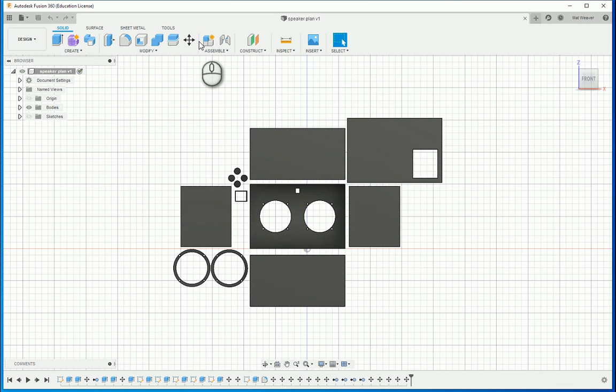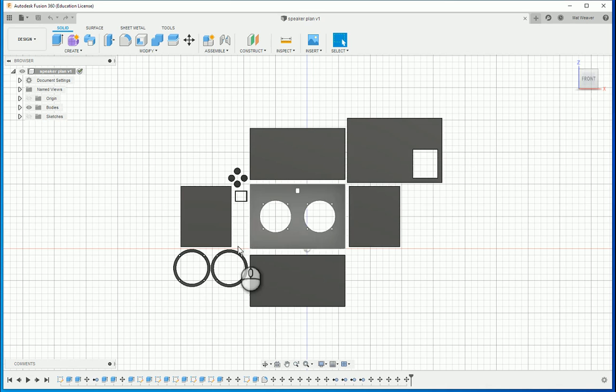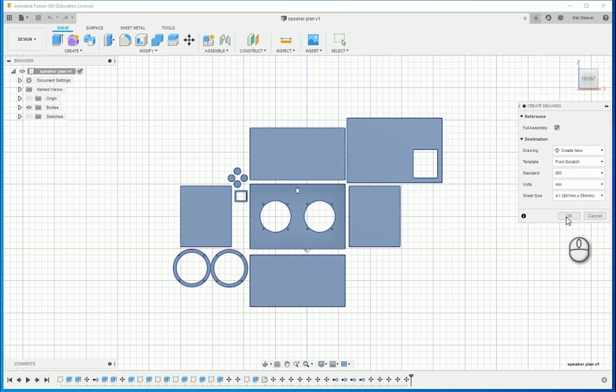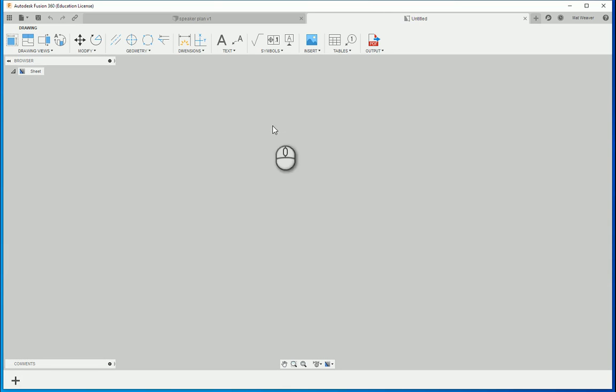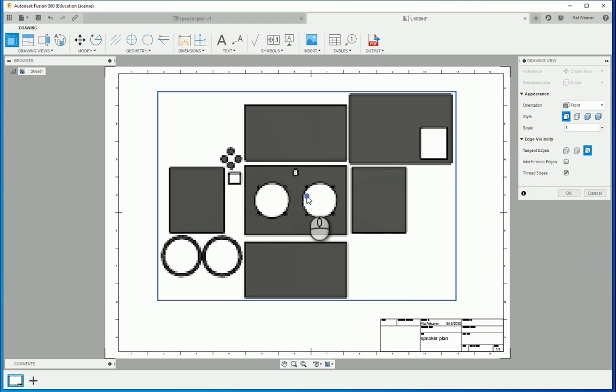After having a massive crash, let's try it again. Make sure you've saved your work because that crashed it. Drawing from Design — you're going to A1 or larger. It might actually be able to do that on A2. We're doing the full assembly, that means everything, then click OK. What that's going to do is open up a page that is A2 — that's double A3, so you won't be able to print it, but that's okay because we're not printing it, we're cutting it. We're going to go scale of 1 and plot that there. We're not going to have any hidden detail — we only want what we can see — and press OK. Now you can highlight all this and delete it — you don't need that.